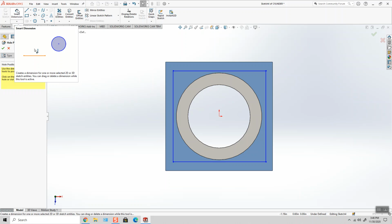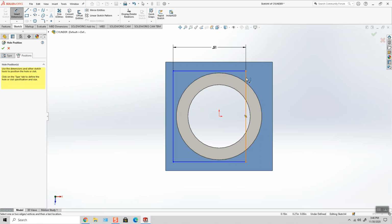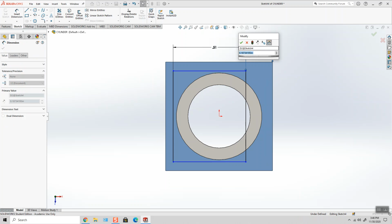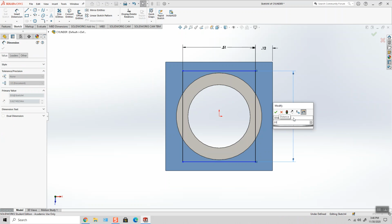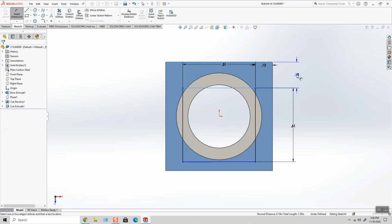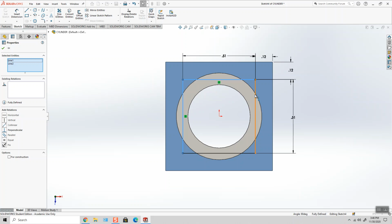And this rectangle is going to dictate the hole locations. So from one hole to the other, it's 0.51. And according to the blueprint, it's 0.12 from the edge. So I'm just going to go ahead and dimension it how they have to avoid confusion. So again, I'm on the cylinder blueprint in the top view and just filling in the locations of these tapped holes.